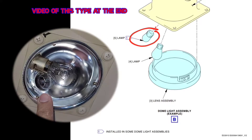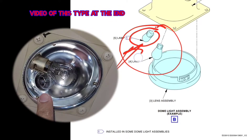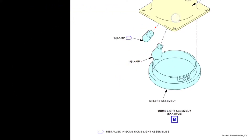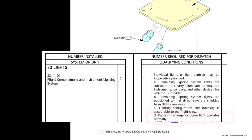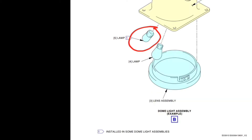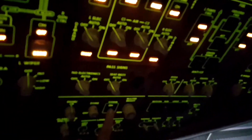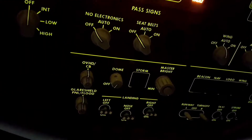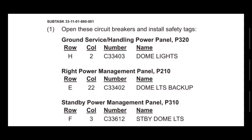On our aircraft, this filament is only on the captain side — it is not available on the first officer side. The captain dome light has two filaments: this is the emergency dome light, and this is the normal dome light for normal operation. Nice-to-know information: the captain emergency dome light is not covered under MEL, meaning it is a no-go item — you cannot release the aircraft with the emergency light inoperative. First and foremost, we will isolate the circuit so that power will not be supplied to the dome light.